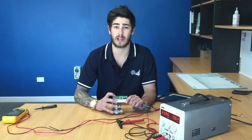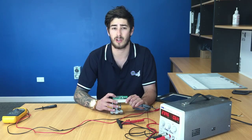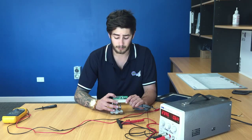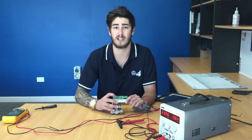There are dip switches located within the unit. These dip switches are used to set up the speed, the span, and the torque of the unit. The speed and the torque work in conjunction with each other using only the first two dip switches. The span, which is the revolutions, is set up using dip switches three to eight.